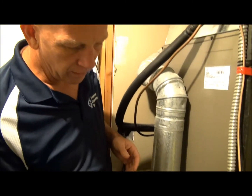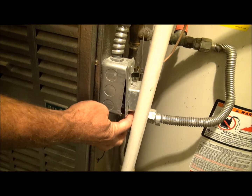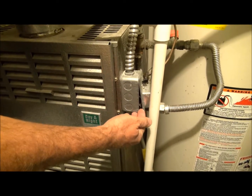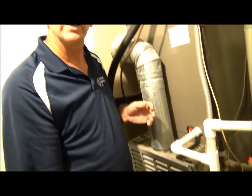After you're done taking a look at your GFIs and your breaker box, just take a look around your house and look for things that might be dangerous — loose frayed wires, maybe electrical plugs that might not be attached. This is one example here. This is on a furnace. As you look down here, you can see we've got a cover plate that has one screw on the top, no screws on the bottom. If you were a child and you wanted to stick your finger in here, or start shoving quarters, dimes, and nickels in there, that's a real good way to get yourself electrocuted. A $0.10 fix — the cost of a screw. The $10,000 fix is burying a child.